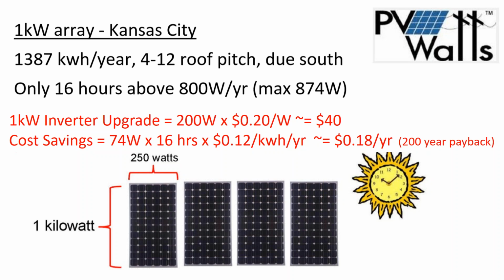The test condition of the module rating is really a day like today where it's cool, like 60 degrees outside, bright and sunny, no humidity, the birds are singing, and everyone wants to have class outside because it's a beautiful day. That is standard test condition, but it's not 60 degrees Fahrenheit most of the year. And when it is 60 degrees Fahrenheit, that's in the spring and that's good, but very soon it'll be the winter and you're getting less sunlight.